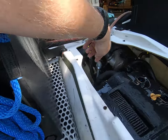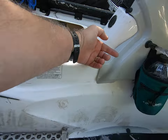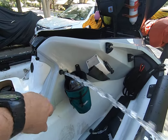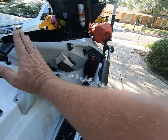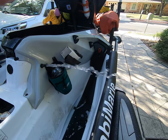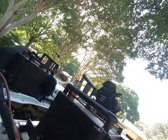The bilge comes from back here, runs up here, and I've got the fitting through the hole here, then through this shroud portion. The nice thing about it is, since it's on the slant, it comes up and over and you can see it if it's firing. If you put the bilge behind you, when it fires you won't know if it's firing and you've got a water problem taking on — so that's about it.